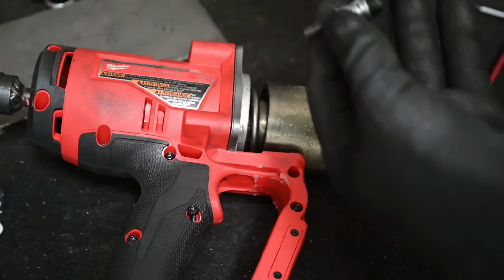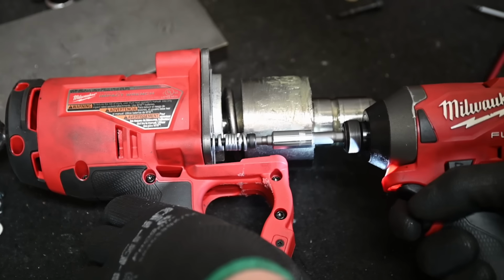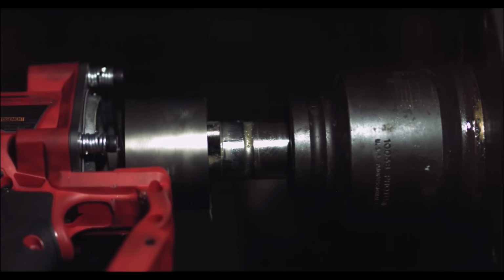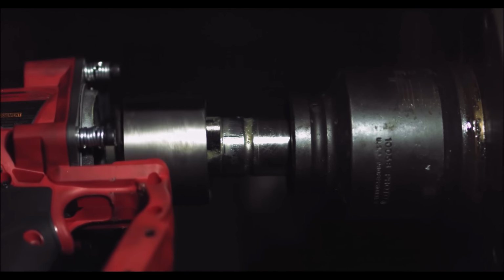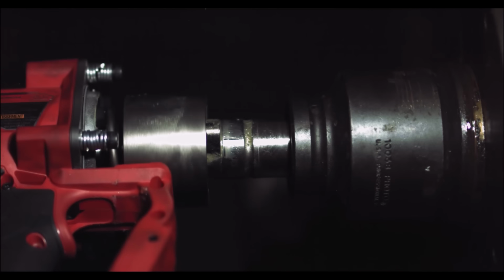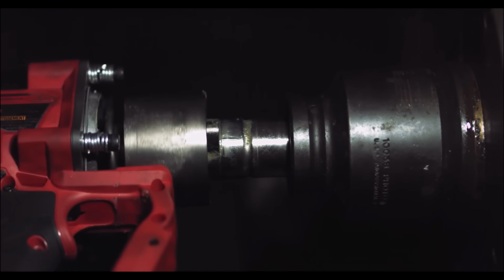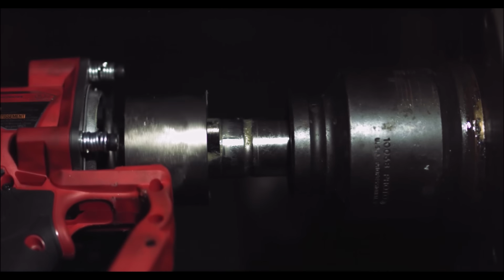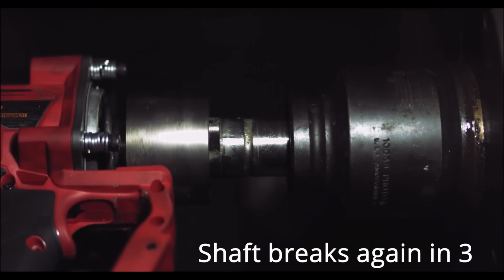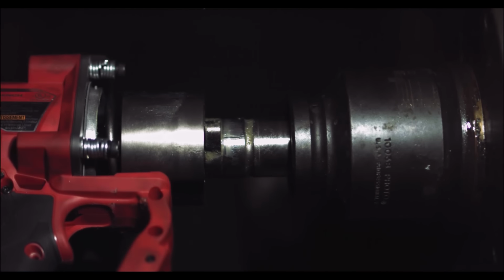And what we learned was this: the spring on the hammer is maybe just too weak sauce to be overclocked this hard. Not a new phenomenon for us on this channel, and this is made worse with an open nose cover shot like this because it's not being all kept snug together. You need to push forward with it, but the hammer would spin so fast that the anvil dogs would just over-rotate past and hit the next to be pinched down on that nose cover and land on the hammer face as that hammer returns from the spring force. That pinching happening many times resulted in the input shaft breaking and then seizing the bearing, which causes all this smoke.